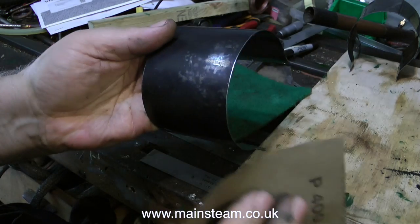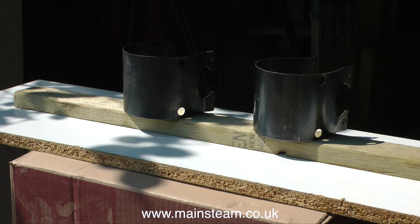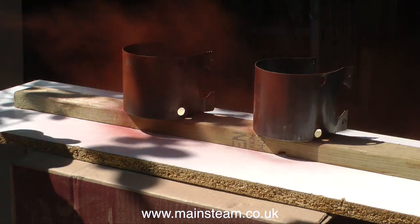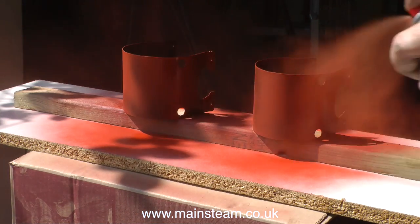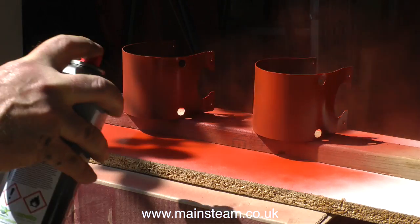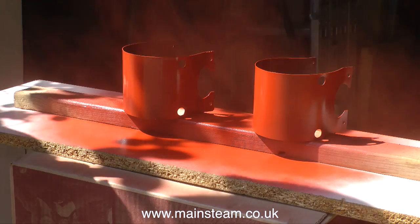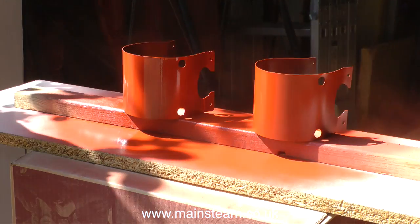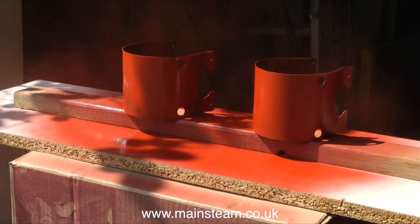Spray paint! Normally I would use a small paintbrush and synthetic enamel paint, but for things like this, spray paint does look better. So after they've been roughed up with the sandpaper, it's time to give them a coat of red primer. I much prefer to spray things outside. I have done it in the workshop from time to time, but it does leave an overspray residue on all my equipment, and I think it's better for your health to do it outside anyway. I would only consider spraying indoors if it was raining very heavily. What you do have to watch in humid or damp conditions is something called bloom — your nice finishing coat goes really weird as the paint appears to react with the damp atmosphere. I generally get a good finish, and I always use a stop-and-start method — that way I don't seem to get any runs.